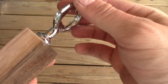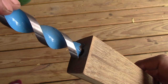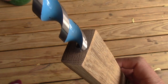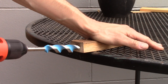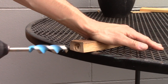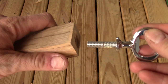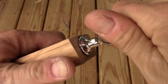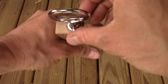My solution is to take a larger drill bit about the size of the neck of the bottle cap opener and just drill off the top part of that stave right there. That creates just enough recession so you'll be able to get your bottle cap opener flush. Then I put a little bit of wood glue on mine — not that it's coming out, just to be safe. With that recession drilled in, you get it nice and flush with the stave and it looks a lot better.